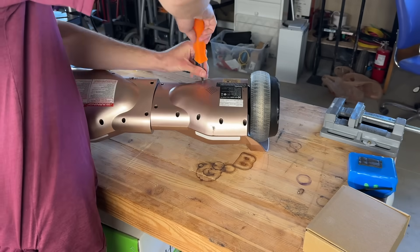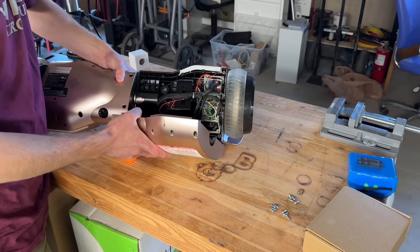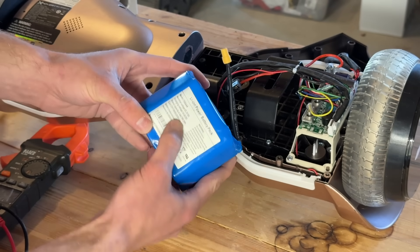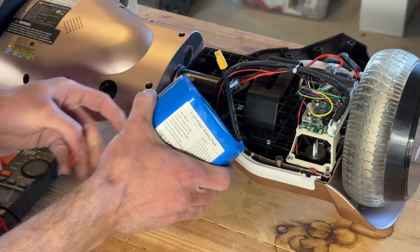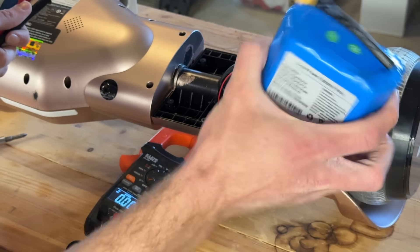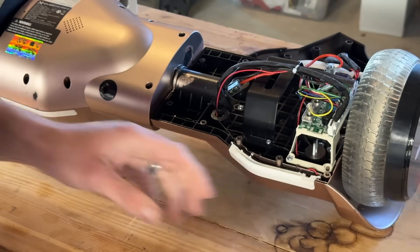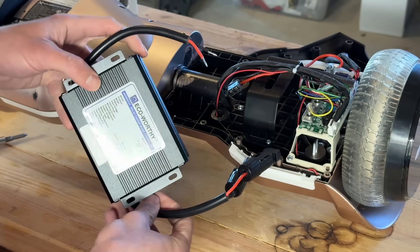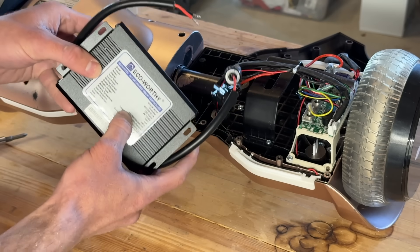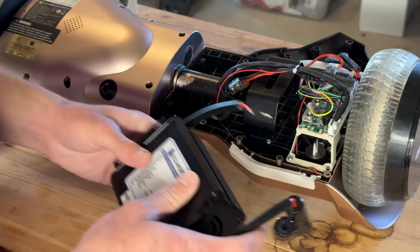So this hoverboard I got for free off Facebook Marketplace, and the very first thing I did was start taking it apart. With the cover off, you can see some of the internals. This is the battery pack that came out — it's a 25.2-volt battery pack, reading only 4.45 volts when it should be over 25. So this pack is toast. I'm not going to be replacing it with another battery. Instead, I'm going to use a solar charge controller — it's a boost controller, so its output voltage is adjustable. I'll probably use 24 volts, or 36 if that's not too high.